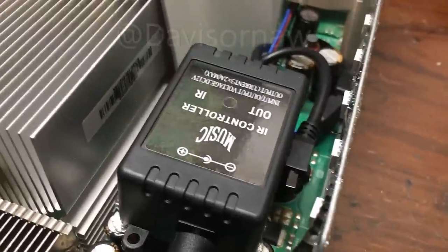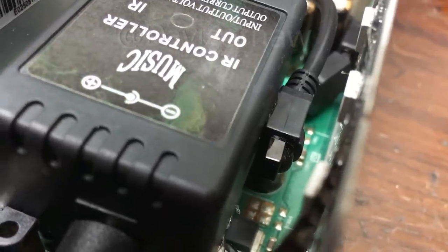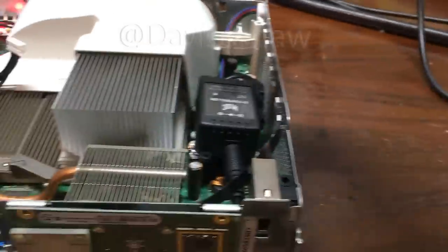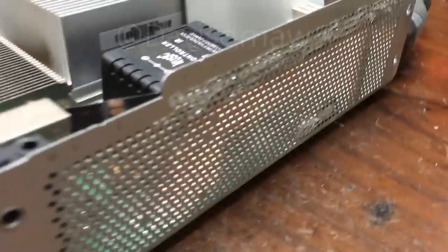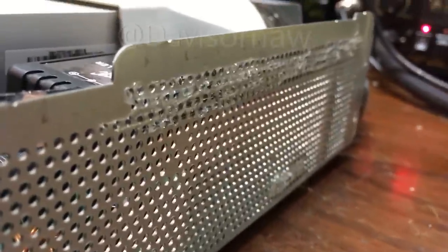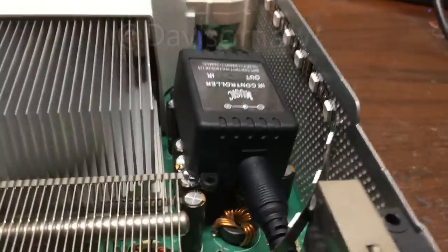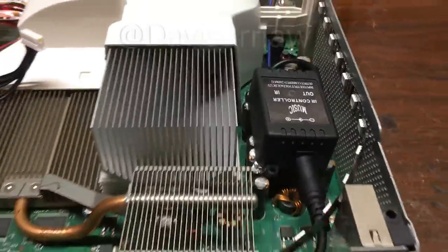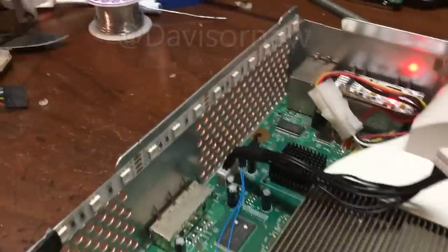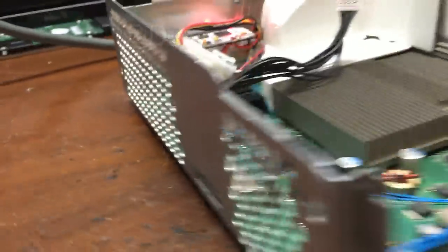He wanted music remote LEDs. The antenna is super-glued right there to the side of it. When the case is actually on, there are going to be vents right there — if you point right at those vents you should get a lot of signal. Let me explain why they're glued here like this. It doesn't look great, obviously, but if I didn't glue these, the LEDs inside would eventually fall. And if they fell, those resistors on the LED strips could touch one of the points on the board and fry the motherboard, or cause other issues we don't want. That's why I glue them — they're really reliable, and plus you're not even going to see that glue on the side anyway, so who really cares?